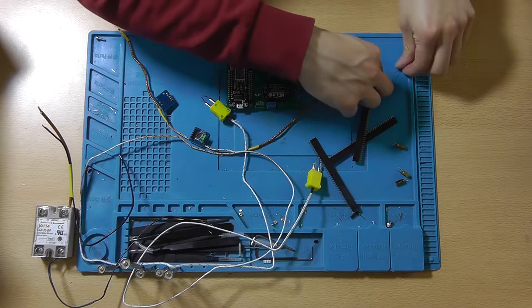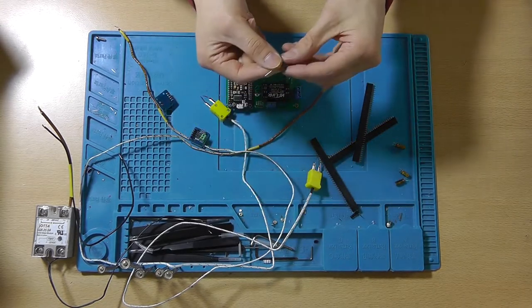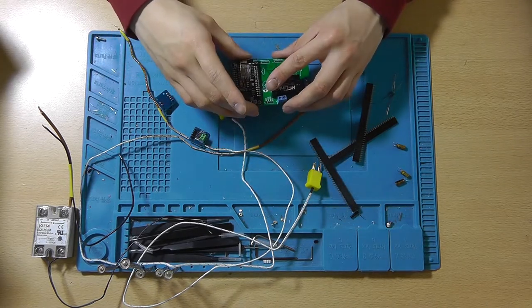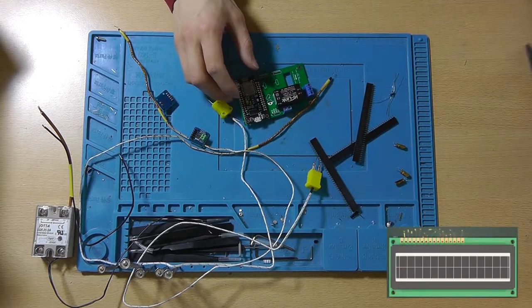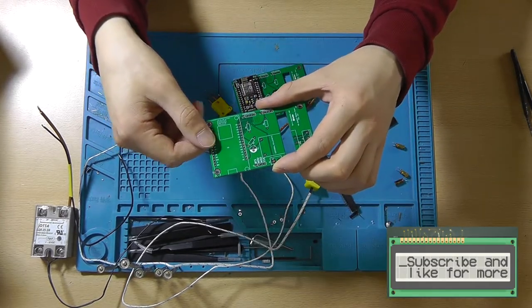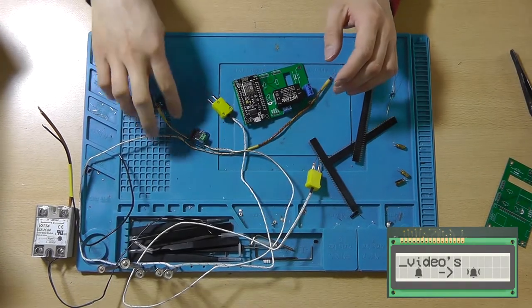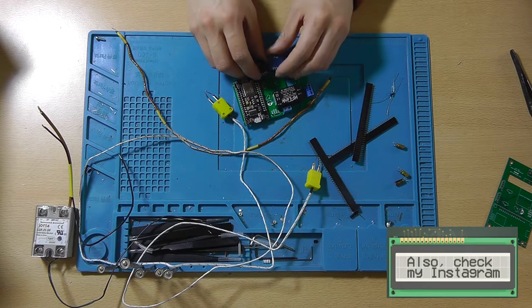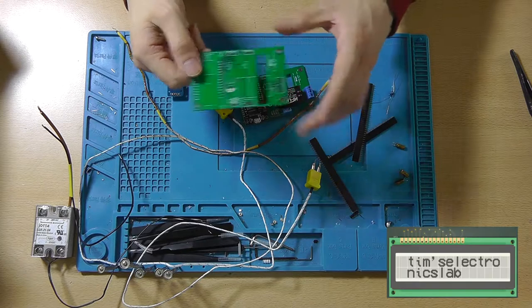Now you'll also need three 1K resistors. Those are pull-up resistors. You are going to obviously need a NodeMCU. Now this is the bigger version, and currently when we look at an empty PCB, there are no pinouts for the smaller version, but I will include them, and I will also fix the problem that you can't put two thermocouple modules next to each other. Obviously, you're going to need a PCB.